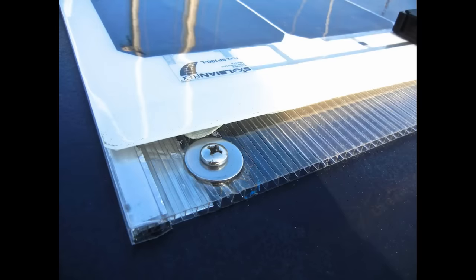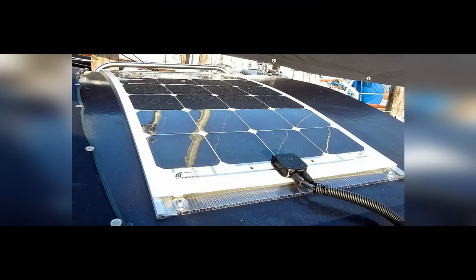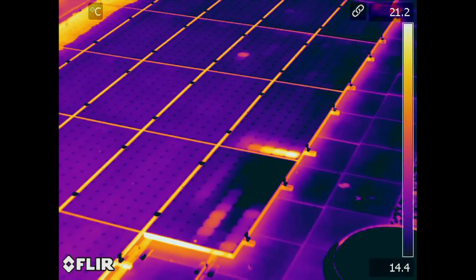Whether you live in a cold or hot environment, flexible solar panels will overheat and degrade very quickly. Some people try lifting the panel to allow airflow underneath, which helps but doesn't fix the problem — a pocket of air creates a hot spot. If any of those cells are damaged, the voltage decreases and that solar panel brings your whole system down. The only way to detect hot spots is with a heat camera. On most glass panels, heat is evenly distributed, but on Chinese-made flexible panels from Amazon there's no information about how well they dissipate heat.